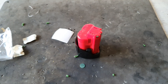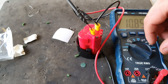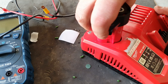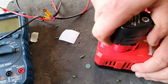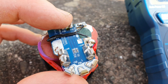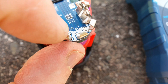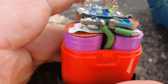So I'll have to test it now. We're showing 10.85 volts, so this needs a bit of a charge - that's probably okay, sticking it on charge now. That doesn't work. We've discovered what happened: it's this board that I got from the Asian continent. It says eight volt here and four volt here and I wired them accordingly, but I've looked it up - it says eight volt here, it shouldn't be eight volt there, it should be four volt, and that should be eight volt. So what I've got to do to fix it is to change around those two wires.